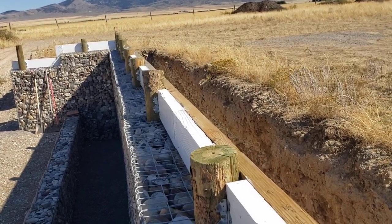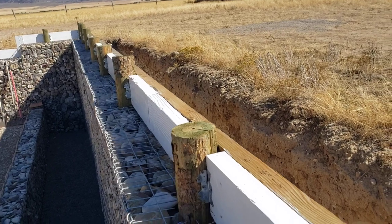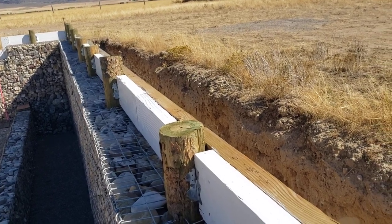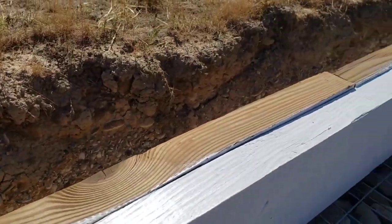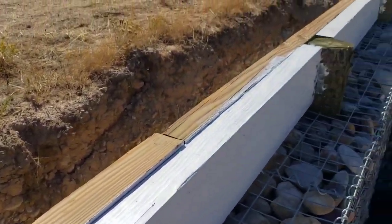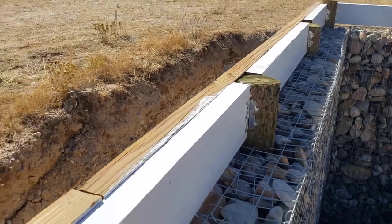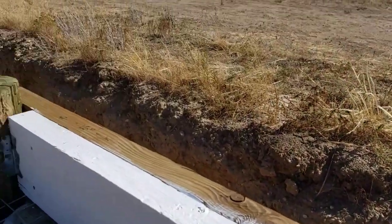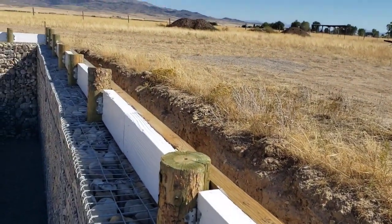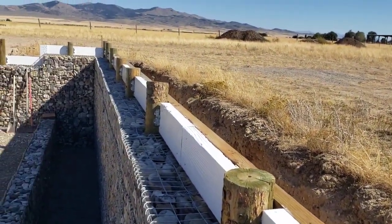This is the front of the building. I'll go ahead and bob those post tops off so it'll be nice and even across there. In between each truss, which is approximately around 34 to 36 inches on center, we will have windows. So the whole front will have windows here. And then our polycarbonate starts on top of the trusses.